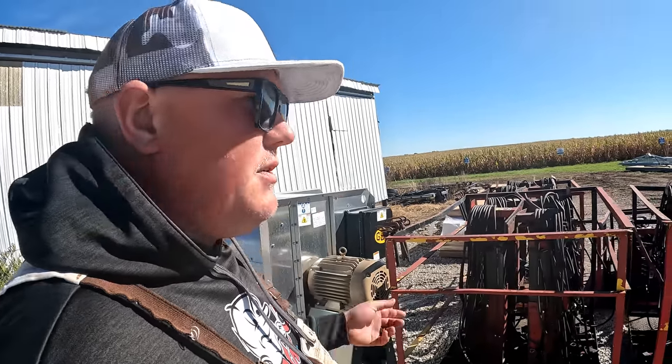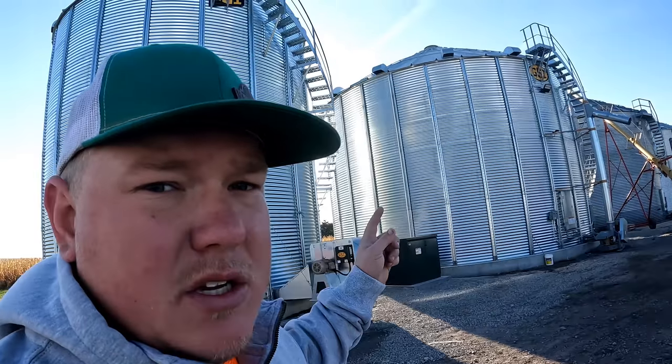Grain bin's been delivered, and then the crew was scheduled to come, which the project was going to take 3 days to construct this grain bin. This is an 18,500 bushel grain bin. It's a 30-foot, 8-ring tall. I think those are 42s by 7s. So actually this bin and this bin, to the cap that's up there, are the same height.